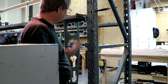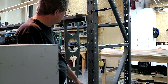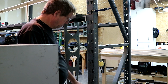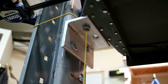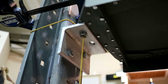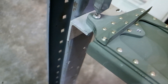Next I can take and set this main spar, or front spar, to the rear spar using the holes and the attachment bolts that I drilled a hole through the center of. Running a plumb bob through that hole and lining it up on the bottom hole — I've drilled the bolts I'm using in the attachment point — so I can put a string through the exact center and the plumb bob can point to the exact center.